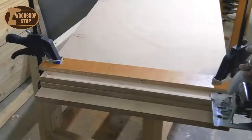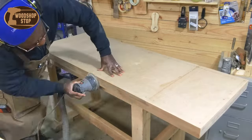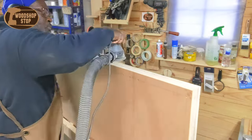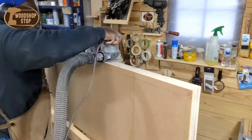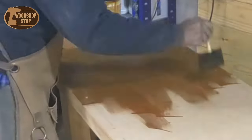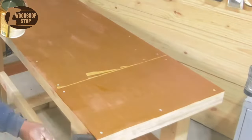Now the bench is dry. I'm going to trim the end as well as trim along the length of the top. I did the length off camera so I don't have a recording of that. Now I'm sanding some of the imperfections and saw marks on the ends. I decided to go with shellac on this — the MDF really absorbs the shellac. This is the bottom of the bench top so I decided to do that first, and I'm only going to put one coat on that.